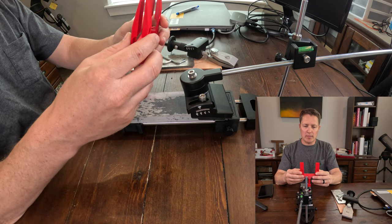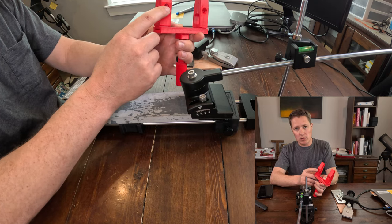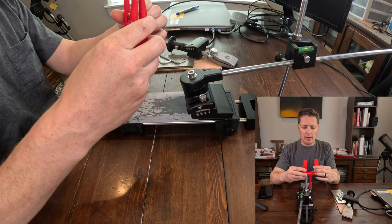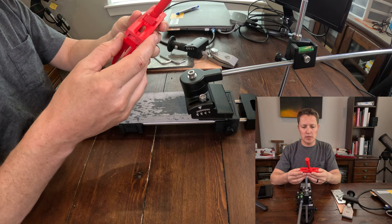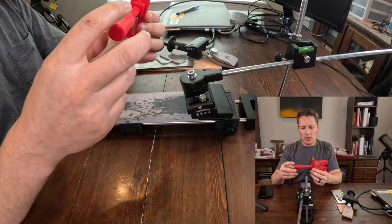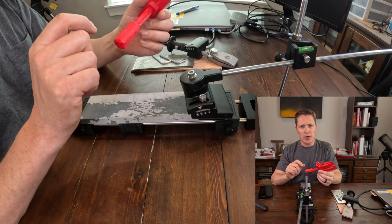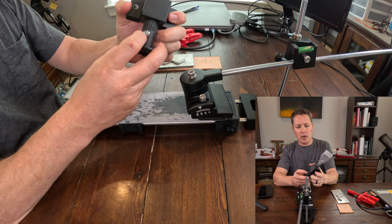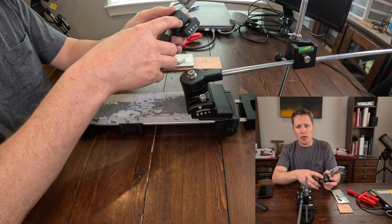Some of the changes are that it's going to have two clamps that clamp down on the knife. There will be embedded steel thread inserts to ensure it lasts a long time. These will be adjustable for smaller knives — they can move toward the center and are attached from the back with screws. Another feature is a new handle. It's going to be a little bit bigger and will have a conical spring on it so there's more of a push when you want to flip it over. You can pop it out, turn it over, and it locks back in place with a ball spring.